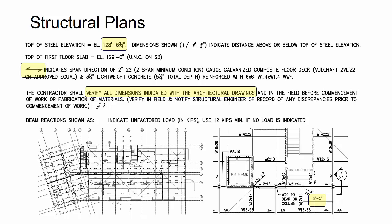Now, oftentimes the fabricator will tell me, hey, please don't write 50 million RFIs locating every beam. So they'll ask me floor by floor or by a general region or area to put the dimensions based on my best guess, or cloud up the areas that are missing, and then submit an RFI for that whole area, asking the engineer to locate those beams or verify those dimensions.